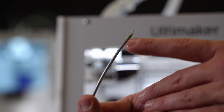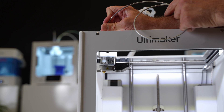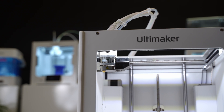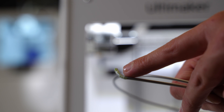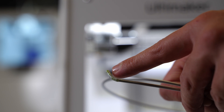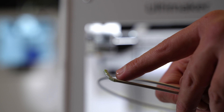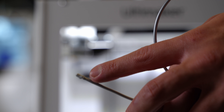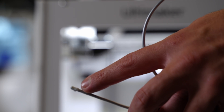We cut the end off and retry. Pushing through again — straight into the silver — build up a little pressure and do a quick, sharp pull back. The pulled piece has a nicer shape that looks like the inside of the nozzle, but still has some green material, so we repeat again. Now we have material that is completely silver, so we're ready to go into the cold pull.